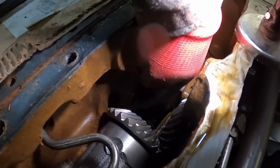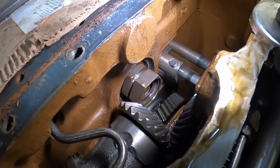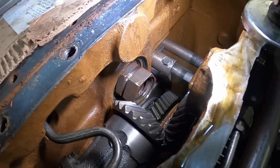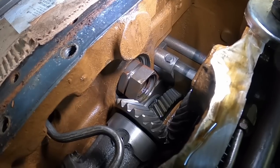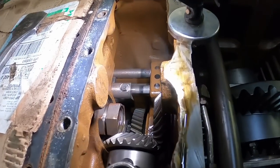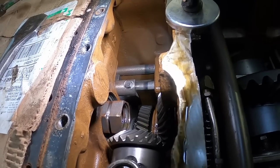Right down here, there's a seal, and the seal housing is there, but the rubber is gone. And that seal prevents oil from walking up the live shaft up to the engine. So, good thing I did open her up. I could get the clutch wet and then it's slipping and everybody's crying, and especially with new paint.